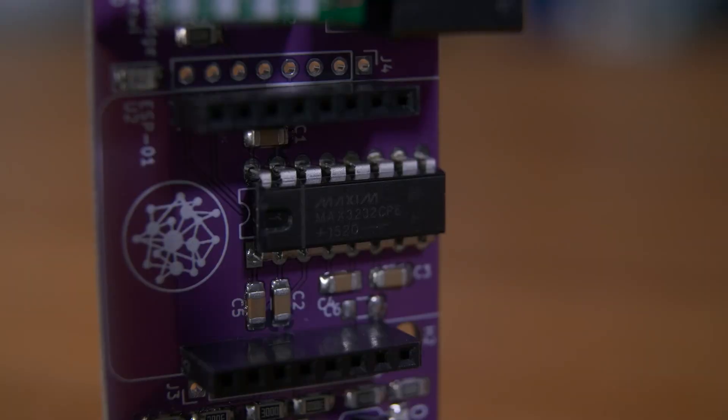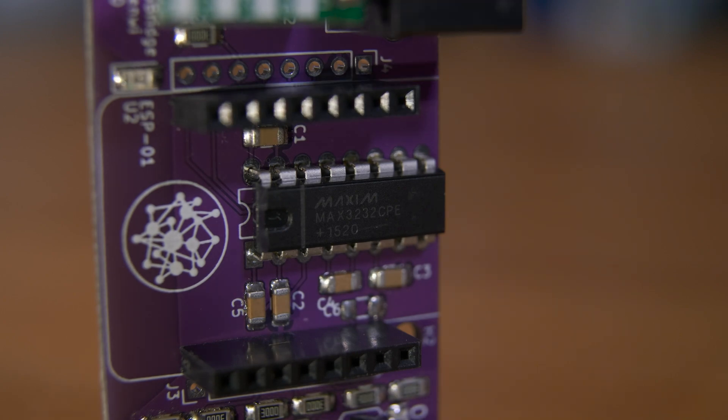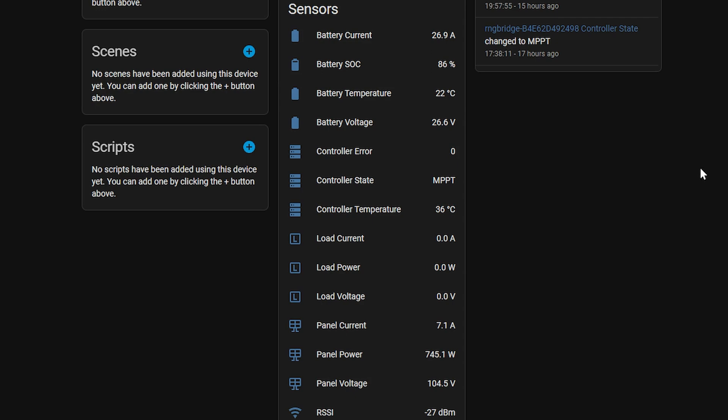As for the controller board, this is a little self-assembled kit from Tindie, which uses an ESP8266 as its brain and connects to Home Assistant with MQTT over Wi-Fi. It uses an RJ12 cable to talk to the charge controller and gets a surprising amount of data — everything from the charging current to the battery, to the power from the panels. It'll even report the battery and controller temperatures and a load of other stuff. This will be really useful to track how much power I'm generating, and should even help automate notifications for when output isn't great and I should move some loads off the solar system to avoid draining the battery.